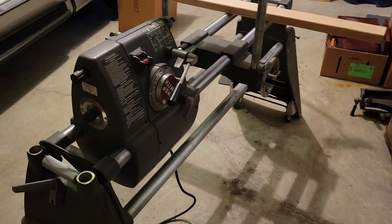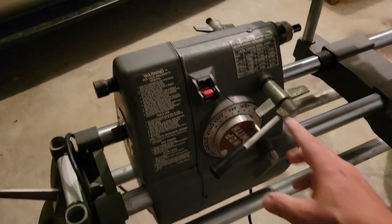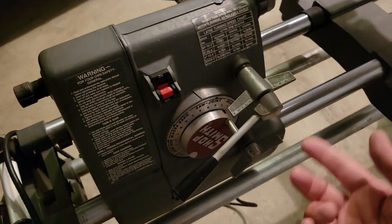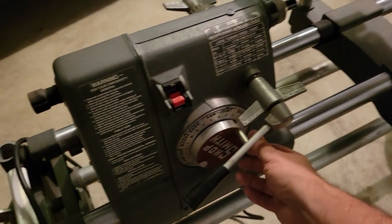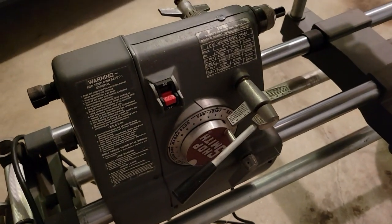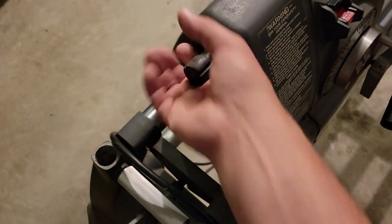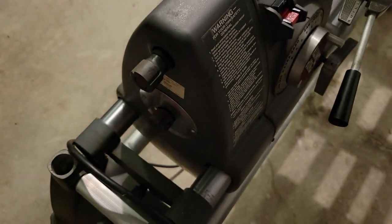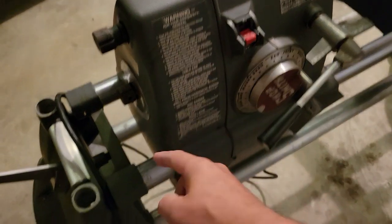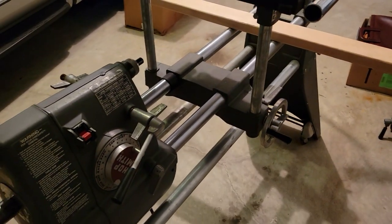Here's my Shopsmith that I bought used. It looks to be in pretty decent shape. However, when I plugged the motor in and turned it on, it worked smooth, but as soon as I increased the speed a little bit, it got bound up and sounded like it shorted the motor out. The belt does not turn particularly well. What has to happen is this motor has to come off, which means this piece has to come off. I'll show you how I do that using the table.